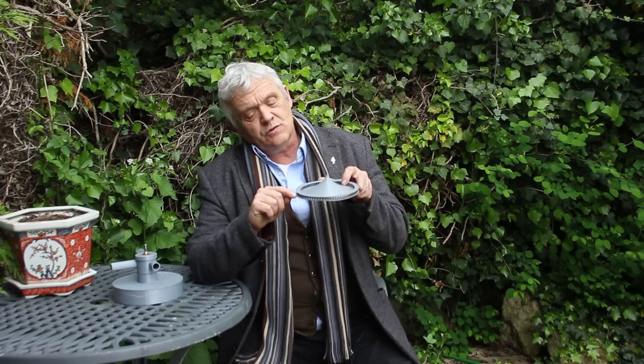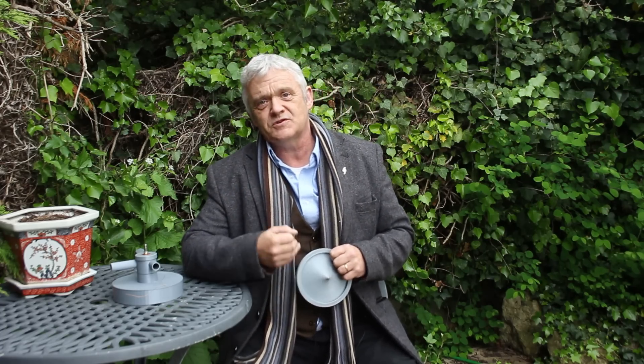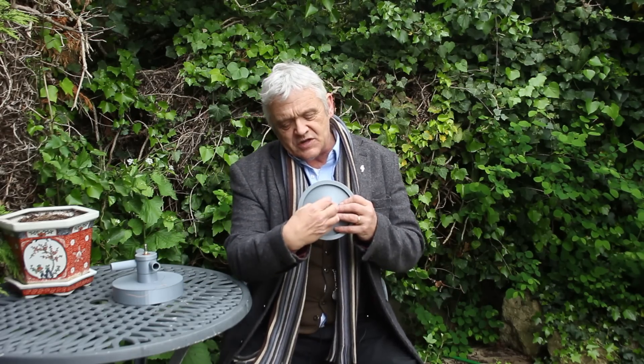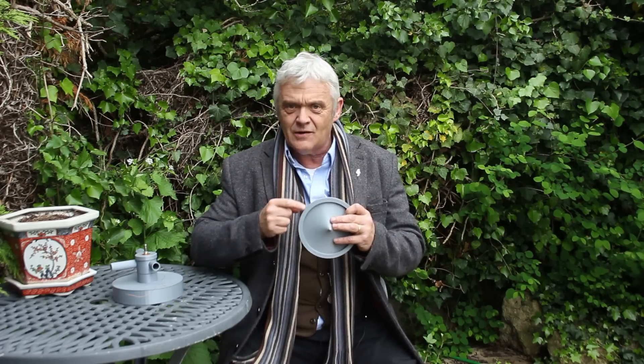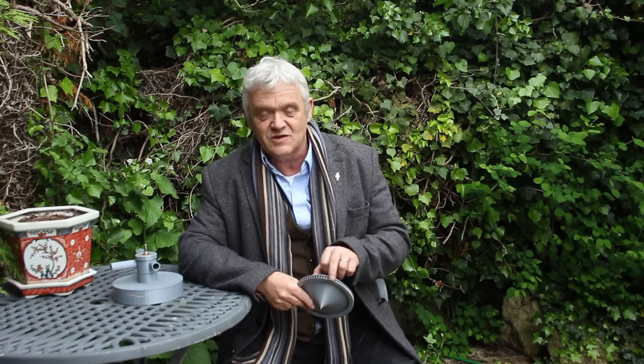There are a couple of things I've done to this rotor. I've reduced the height to only a centimeter and I'm thinking of reducing it even further, because in a wind turbine the only part that gets hit by the wind is the blade — the rest, the wind just goes past it. The tip speed ratio does come in here; it's about six, meaning the blade tip moves at six times the wind speed. But with this rotor — if it were a solid disc it would block the wind completely. This one works really well as a solid disc because it takes the air, separates it in a flow, probably sticks to it via the Coandă effect, and blasts it out of the angled channels which shove it around. So there's no wasted wind in the same way as a conventional wind turbine, and the tip speed ratio probably doesn't have much relevance here — though it might. Interesting rotor available for anyone who wants it.